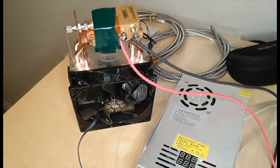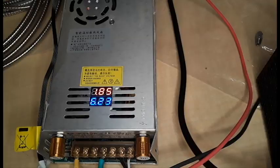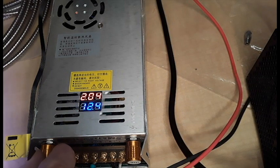While we're on the topic of not letting your equipment explode, make sure to cool the laser adequately. I really like these CPU coolers for the job. Make sure that your cables are actually a thick enough gauge to allow the current required to pass without heating up too much. This was one of my first mistakes.